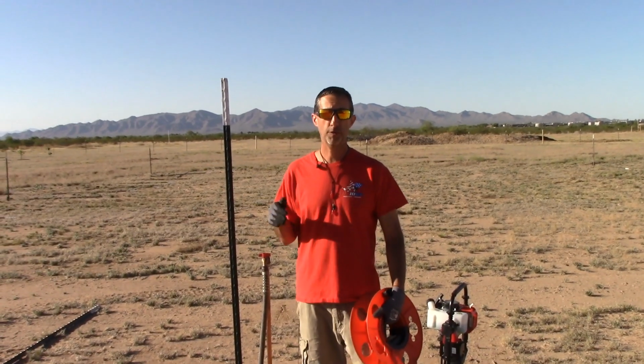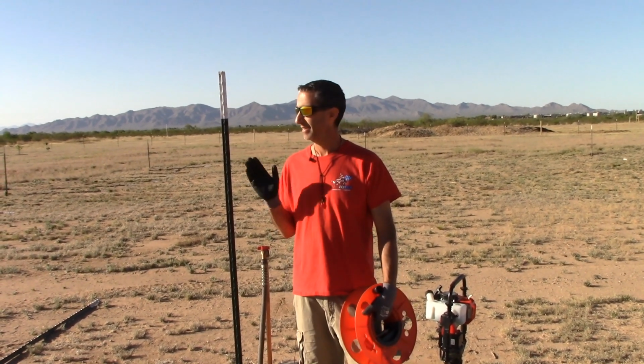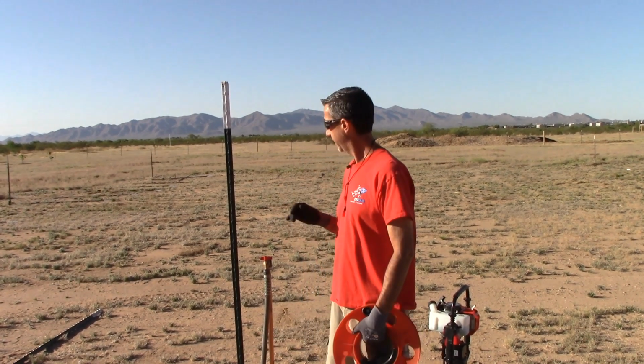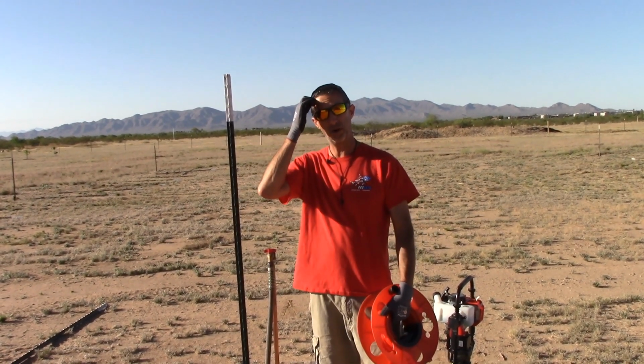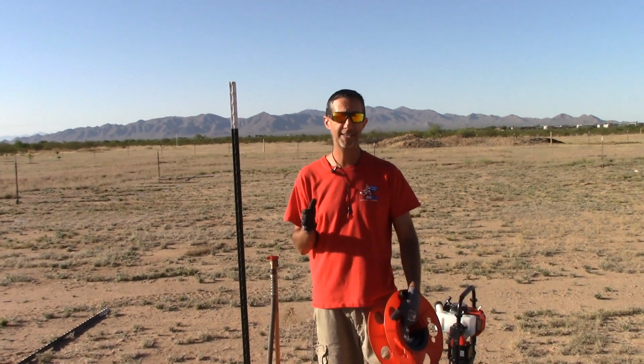We got these 2 corner posts in, so you can see we ditched our efforts on trying to get it level while we were pounding it in. That post driver really makes the bubble kind of a mess. So we came back and just basically bent the bars. You can kind of see me doing that. We bent them with the level. So now we know these 2 are nice and straight.